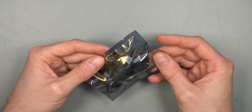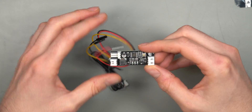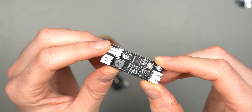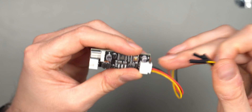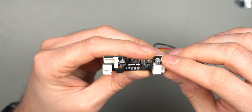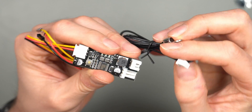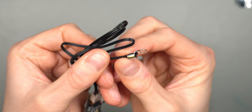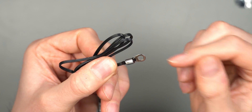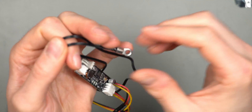The first module comes in a nice anti-static bag. Inside is a very small PCB with a three-pin fan header - you can actually power this using the header on your motherboard, though the motherboard won't control the fan; this board controls it according to temperature and your button settings. It has the plug for the probe itself, with a long probe cable that you can screw or zip-tie in place inside an HDD caddy, for instance.